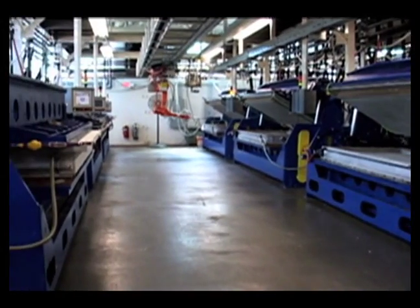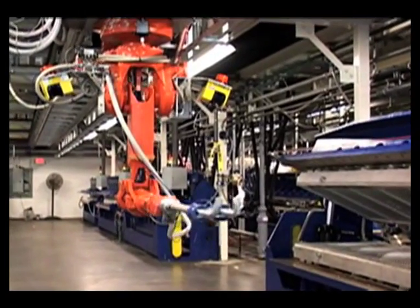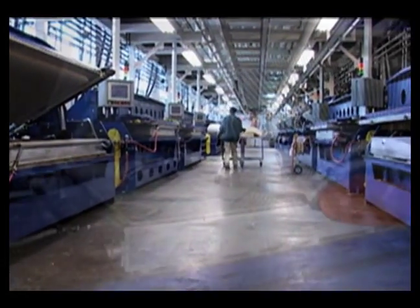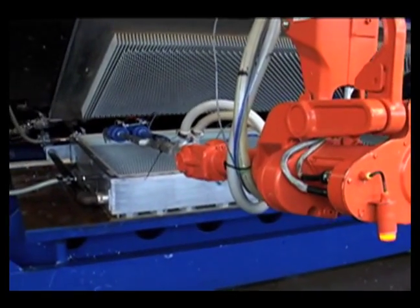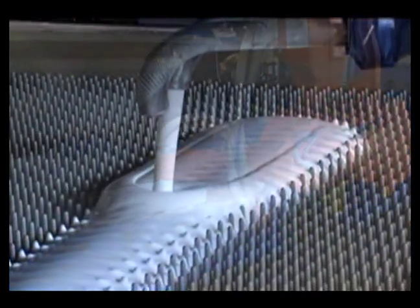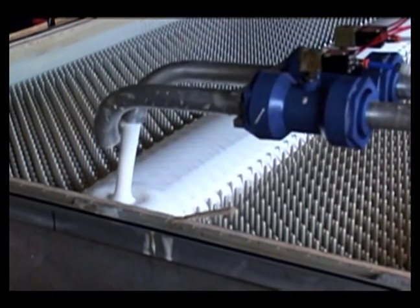The press room is made up of four banks of twelve presses. Each bank has a dedicated robotic arm. The press room was designed with ample room for expansion and to accommodate an additional bank of presses. When the compound arrives at the press room, it is whipped into a foamy liquid and transferred to a robotic arm for injection into pincore aluminum molds. These molds create the unique aerated cell structure of the Talalay latex and facilitate heat transfer during the curing process.